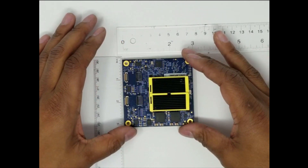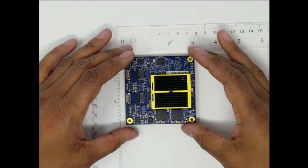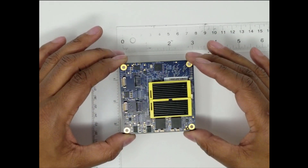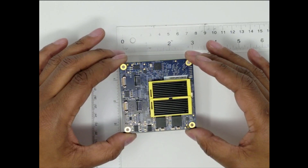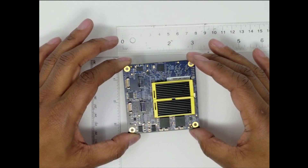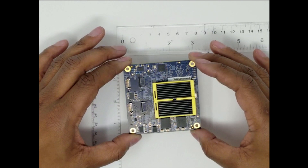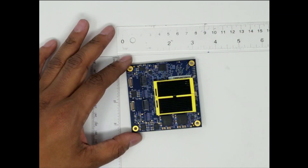As you can see, it is an ultra-compact module measuring only 3 inches by 3 inches, which enables at-speed production testing as an emulator or transmitter and/or a frame grabber or receiver that can perform functional and packet error rate testing. Engineers can use the SV4D for wafer sort all the way through to production final test. The module has been designed to be readily integrated on any ATE load board with minimal external components, including high-speed interface cables like you see here.